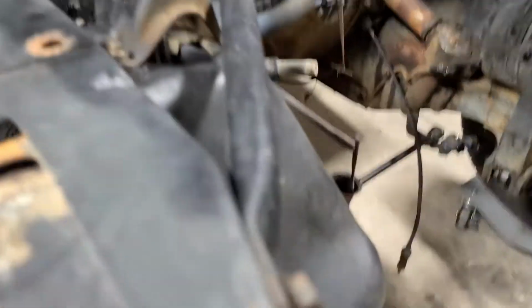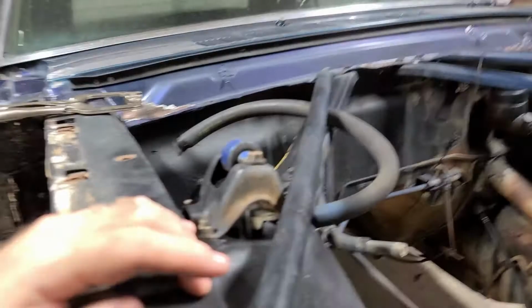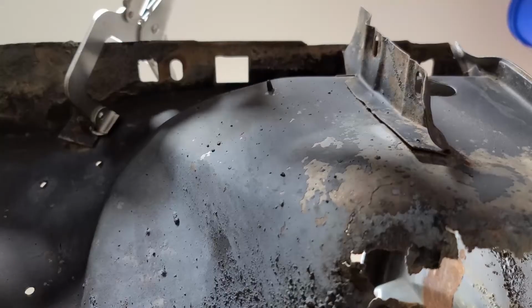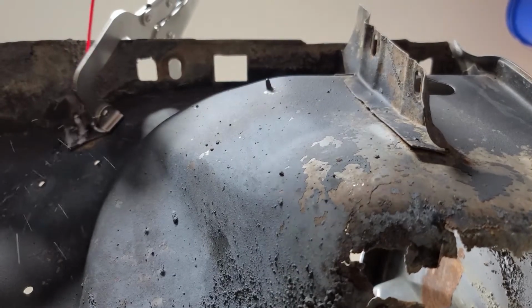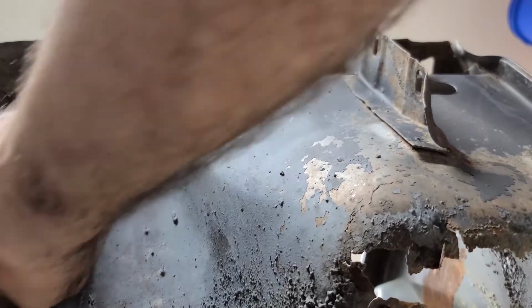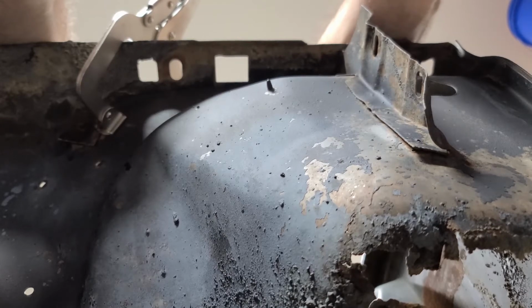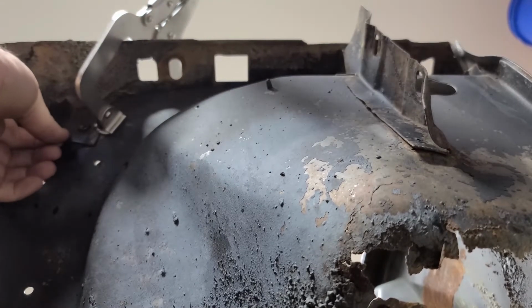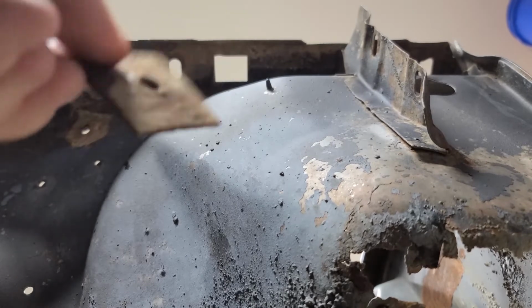The very first thing I go to remove is this bolt to get out this brace that goes on both sides. It's extra for the convertible. It's bolting into this panel that we need to remove, and this guy is spinning. I don't know if it's normally tack welded in there or not, but I'm going to use a clamp to clamp it down and then unbolt it. I guess it's not ever tacked on there. I don't see anything that would suggest that it is.